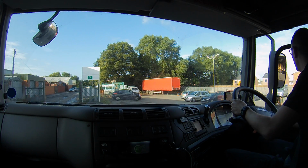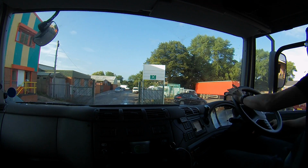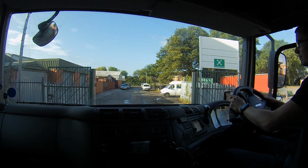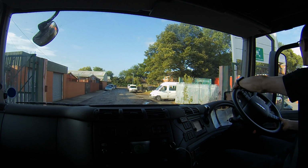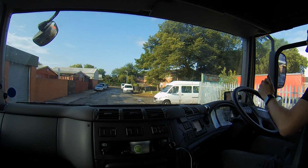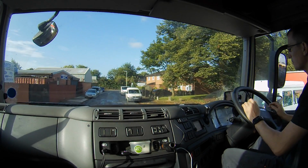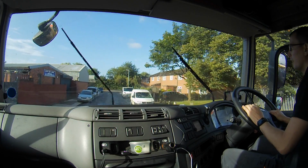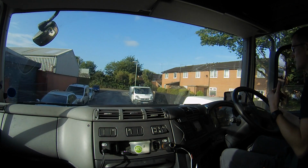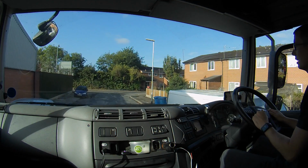Right, they're off. I've just adjusted that mirror a bit. Okay, so I put an extra strap on that. Yeah, this is a strap on. I put an extra strap on. So I've got 3 that are up. They're good for up to like, I don't know, 6, 7 tonne or something. I've just asked the boss to check the actual weight of the items on the front. It comes up to 4.5 tonne. So I was about a tonne out.